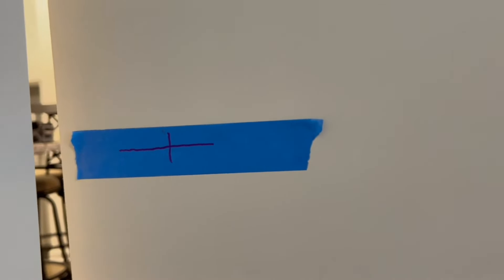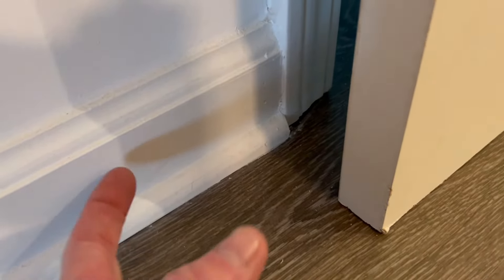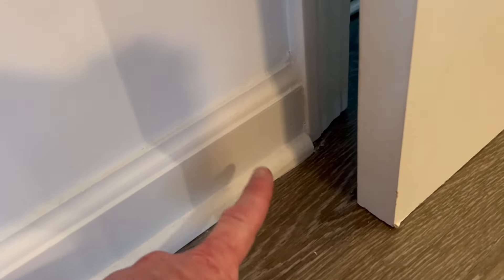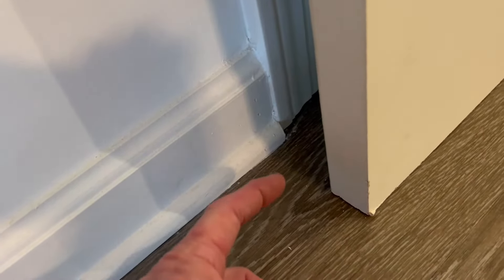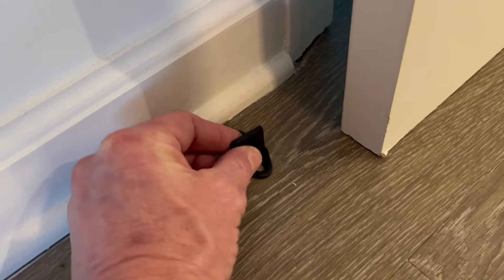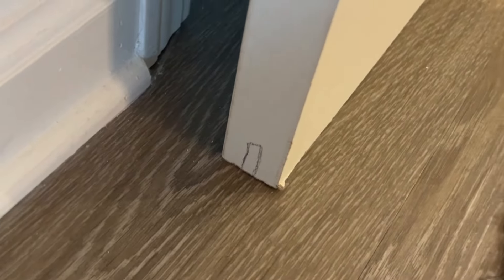Of course you want the pull on the correct side of the door. The bottom guide keeps the door from moving side to side. Sometimes you can buy L-shaped or U-shaped guides that go on the floor and the door glides between them. Sometimes they mount to the baseboard — you get a U-shaped piece of metal, sometimes with a wheel on it, that screws into the baseboard and the door glides through. This kit comes with a guide that mounts to the floor, which means you're going to have to cut a channel in the bottom of the door. Some barn doors come with that channel pre-cut, but if you're buying a door off the rack you're going to have to cut it.